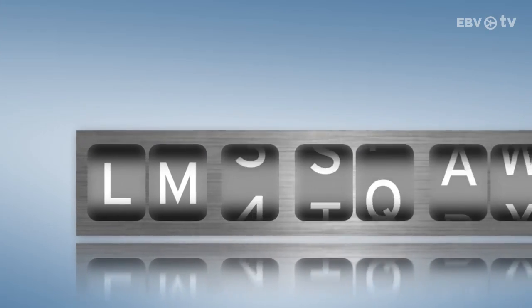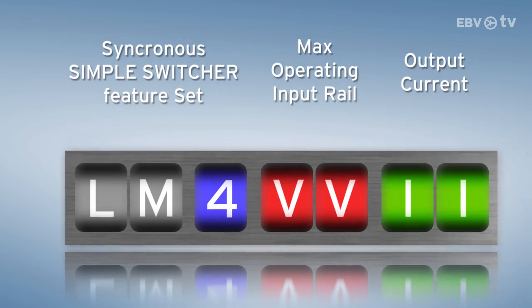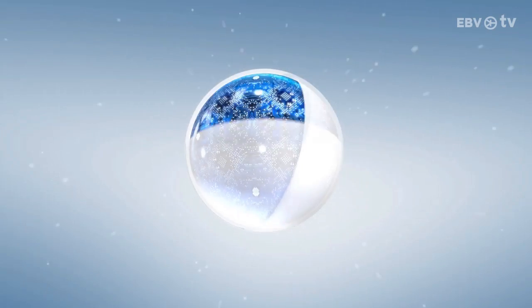Even the product numbering is simple to enable you to find the right product quickly. Full scalability is possible as each member of the family has exactly the same HD SSOP 16-pin package, 5 mm by 6.4 mm, which makes for easy designing across a range of different systems. An identical footprint can be utilized across a wide variety of applications — scalability not available before in a synchronous family of this size.